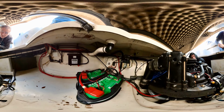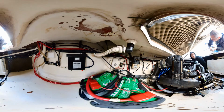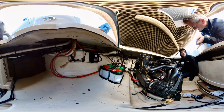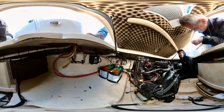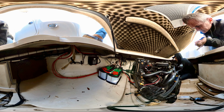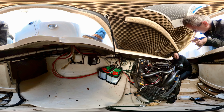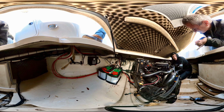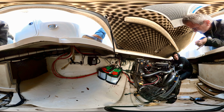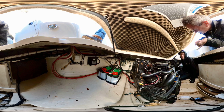If you're in a hurry and you don't want to wait on the blower to run, you can always just open the engine hatch and let it air out. Or if it fails and you're waiting on a part, you can just pop this puppy open for a few seconds and it's fine. And with the blower, it needs to be 1 to 3 minutes or something. Somewhere in there, like two. A couple minutes. Generally what I always do is, first thing I touch when I get on the boat, flip the battery on, hit the blower, load all your stuff on, get your coolers, whatever else, and then you're good.